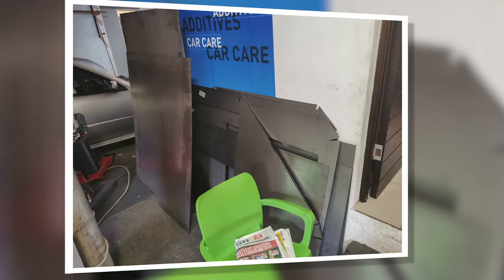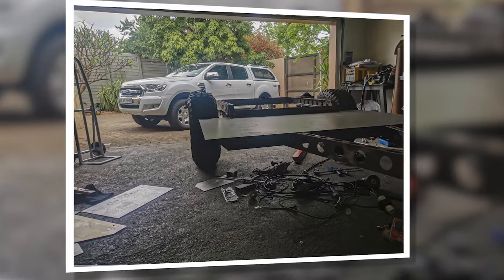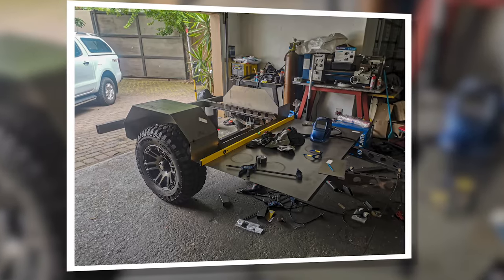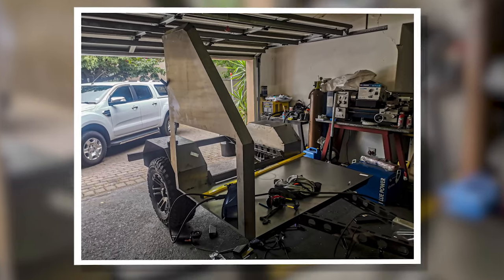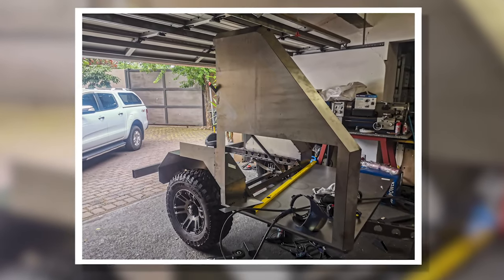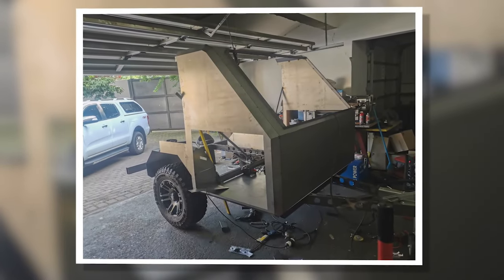Now with the main chassis back in my garage, the first batch of laser cutting was ready for collection and I could start building my camper. This project was my very first time using a program to create and export a DXF file for CNC laser cutters to cut from. This made me nervous as there was no way for them to check anything on their side — it was simply load a sheet of steel into the CNC machine, load my file up, and it would cut it. I had to pay up front, so in the event that something was wrong or I missed some scale or export setting it would be a total loss. As you can see in the pictures I ordered the whole outside shell — 12 full sheets of steel. Surely it would have been a better call to order a section or two and test the fitment, but Captain Marius went ahead with the complete order. Thank my lucky stars it worked.